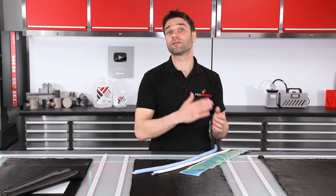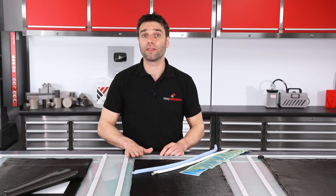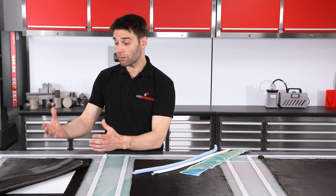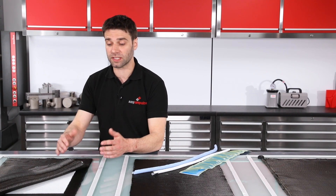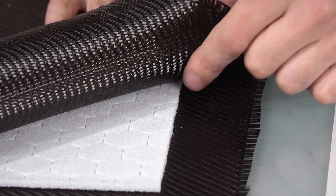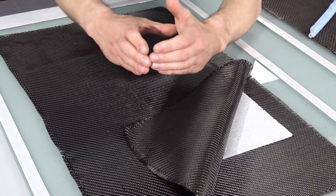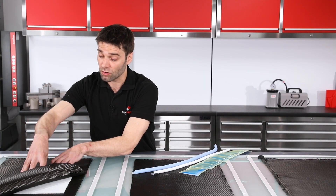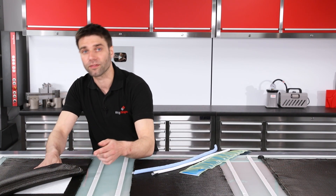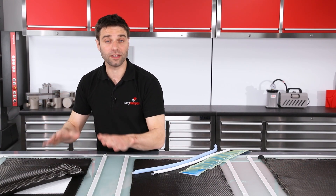The two samples we've got here are three plies of 210g 2x2 twill. One I'm going to run without the MTI system and the other with the MTI hose. The final sample is being run with a 5mm core. The reason I've set this up is it creates a very common situation where bridging around the edge of the core creates a resin pathway, acting almost like a spiral — the resin will quickly track around the outside of the core and then have to infuse inwards, which will very often leave dry spots or pinhole areas in the centre. Normally you would put a chamfer on the edge of the foam to help, but this is to exaggerate the results and illustrate how these materials perform.